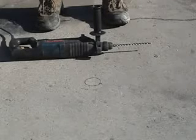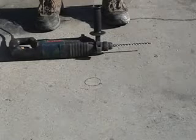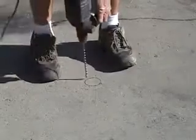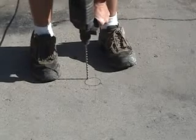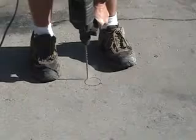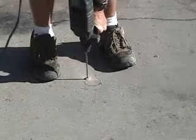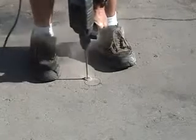Wear good safety glasses. Drill straight down as best you can. Stop and pull up once you feel the bit pass through the concrete — we do this in order to eliminate hitting any plumbing that might be buried below. The idea is to drill holes around the entire perimeter of the circle as close as possible, but not so close that the drill bit tries to jump over into the adjoining hole.